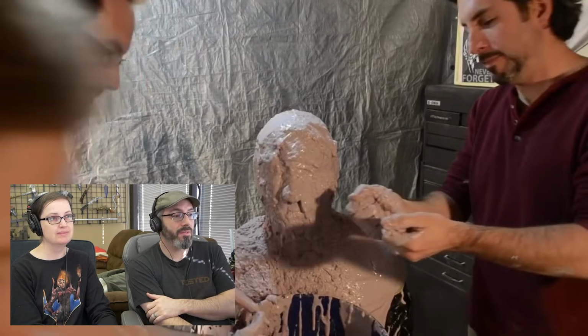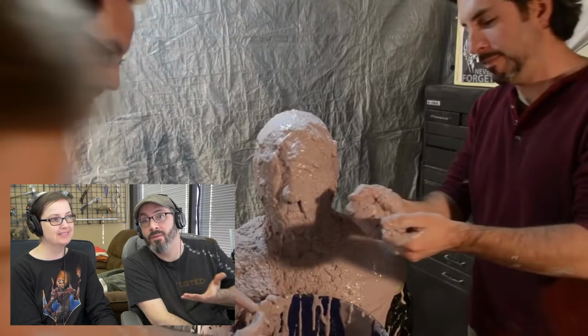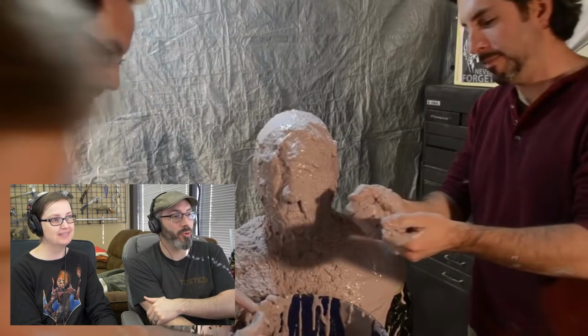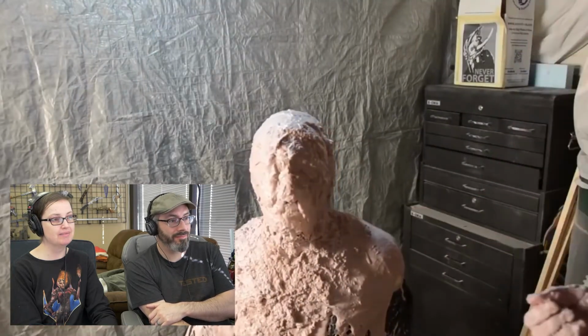So it was one of the reasons why our first attempt failed, just because you only have one shot. You can't just keep adding more. You can't pile it on. In fact, once the alginate has set, you can't mix up another batch and add it on later. It will not stick. It kind of has its own release.